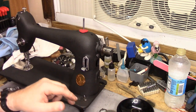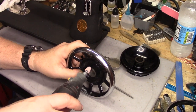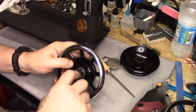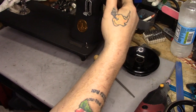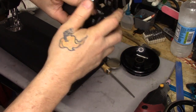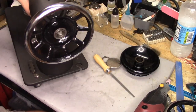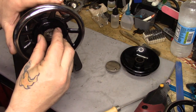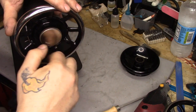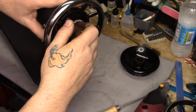I'm going to use a rotary tool with a stone. We'll wipe it out and check it. The edge of the bushing is coming through. It goes on in both directions — we got the burr out and it fits just fine. Let's put a stop-motion washer on it. And there we go — that's all it took.